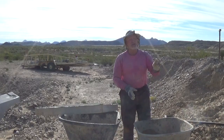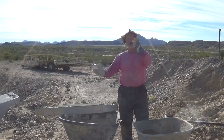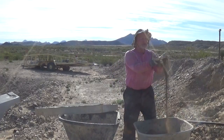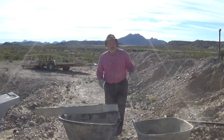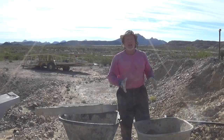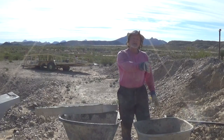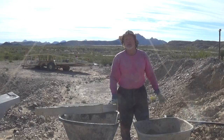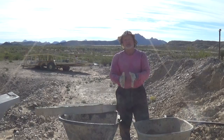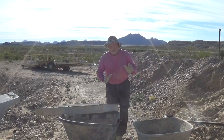I've got some bottle work out here I did seven years ago that's just perfect — no cracks. The cracks I do have are more where the footing slipped a little, and they don't affect the actual structure of the building. One $10 bag of Portland is going to net me 3.5 mixer loads, and there are about 3.5 of those buckets in a mixer load — so that's about 10.5 of those pre-bagged equivalents for one bag of Portland at $10, as opposed to $45. And I get a stronger mix, all out of my native soils.